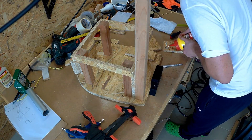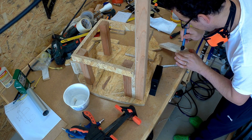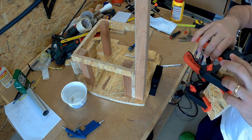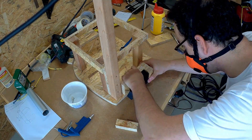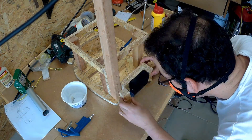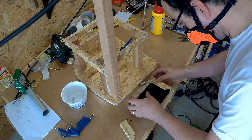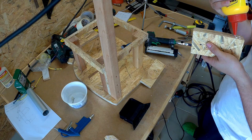The L-Box attachment consists of two main parts: one which stays fixed and another that pivots on a steel rod. It also has a spring to maintain the hook in the closed position. This makes the removal of the whole support as easy as pushing the handles inwards to release the hooks. The whole construction was really not planned — I just kept adding OSB pieces to build a small, sturdy housing for the L-Box mechanism to work in.